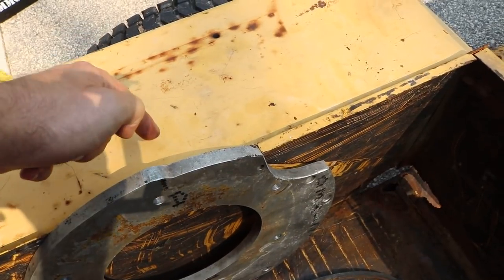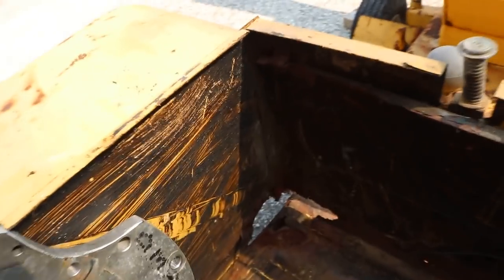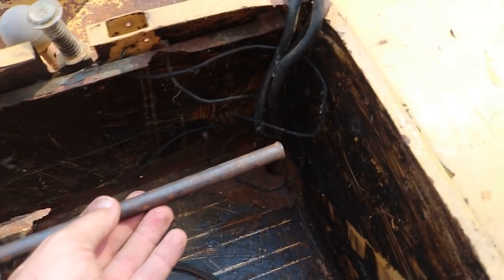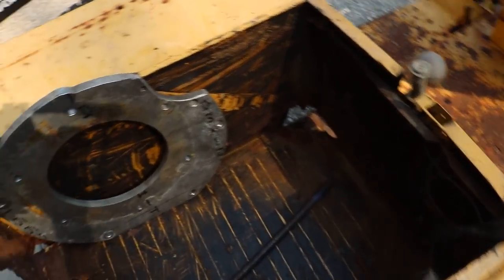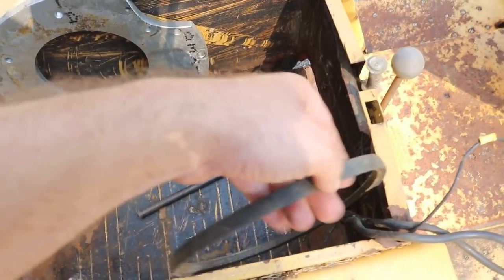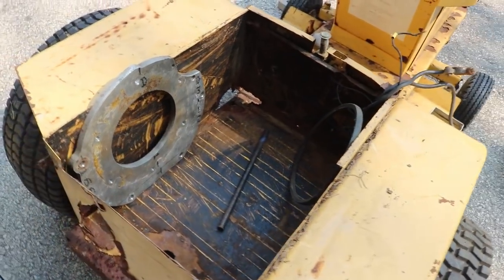What I'm thinking is to have a chain from the motor up to a jack shaft under the fender. I would cut a hole right here, add a bearing, and put maybe a three-quarter inch shaft straight through with a sprocket on one end. The other end would come to the other side, also going through the body to a pulley — because straight down right about there is where the input pulley is on the transmission — so I could have a belt going essentially straight down. Motor across here, chain on the outside, to a sprocket, to a shaft, and then that pulley going straight down.